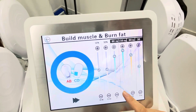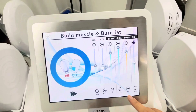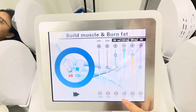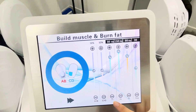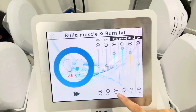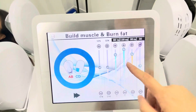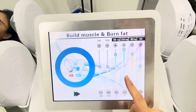We suggest you start testing from 50% because this machine is very powerful — it yields 5000 watts. For frequency, there are F1, F2, and F3 — three different working modes. The cycle runs F1 for 1 minute, F2 for 1 minute, F3 for 1 minute. You can set each mode from 1 to 30 minutes, and total working time from 1 to 60 minutes.